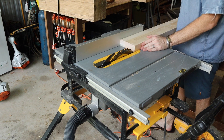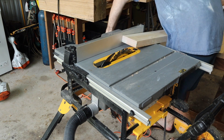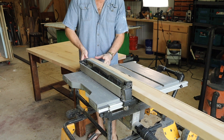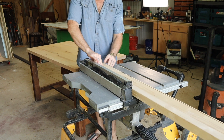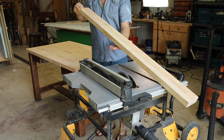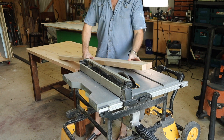The first thing you're going to do is set your table saw between five and seven degrees and take a first arbitrary rip just to set an edge at five to seven degrees. Once you complete this rip, you're going to flip the board while maintaining your 90 degree edge on the fence, so now you're going to invert your five degree cut.